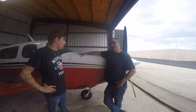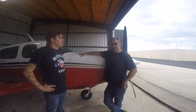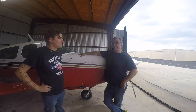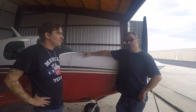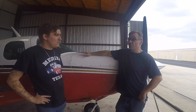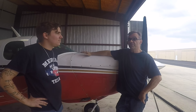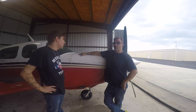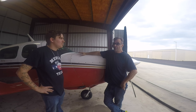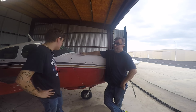It cut that time in half. Here's the cool thing: when you're in level flight cruising at about 65%, you can have it leaned out and be down to about 16.5 gallons an hour, which is not terrible. For 217 knots — if you divide that in half, you're at about the speed of a 172, which burns about 8 gallons per hour. So all you've done is burn more gas, but you're going twice as fast and twice as far. That's something that really drew me to this — you can go 107 knots or you can go 215, but it burns the same amount of gas.